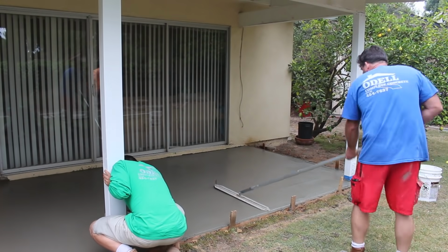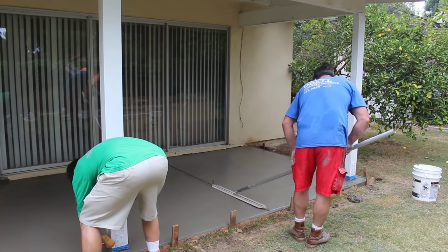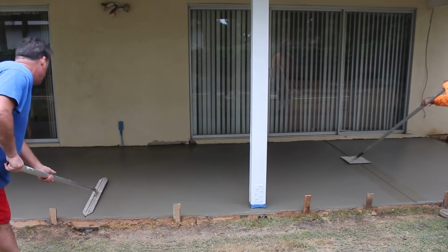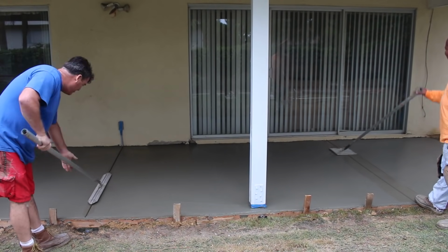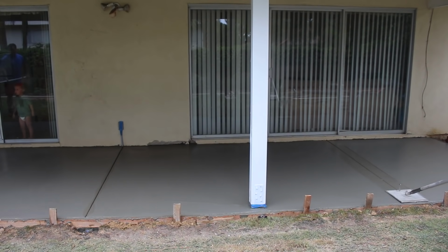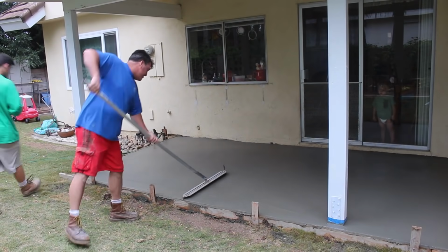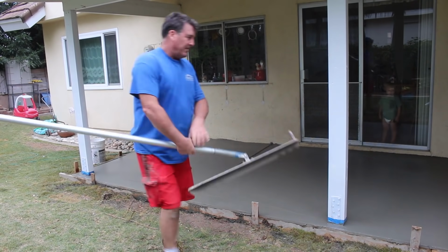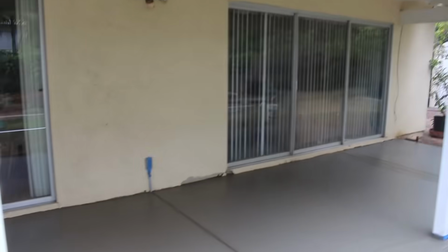So when setting that curb, you want to make sure you allow for that on your slope. Otherwise, you might not have a choice and finish high up on the bottom of that 2x12, and then you're locked in on your strippage, and then you've got a big area of concrete you have to fill in with the bottom of that 2x12.